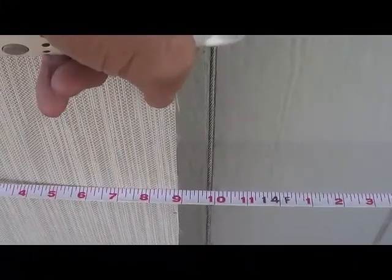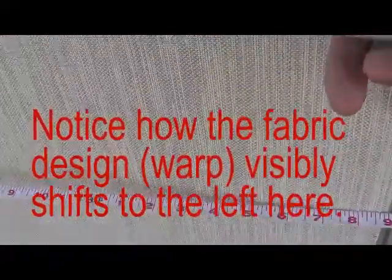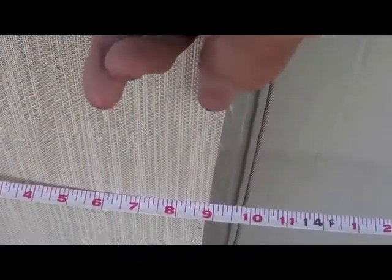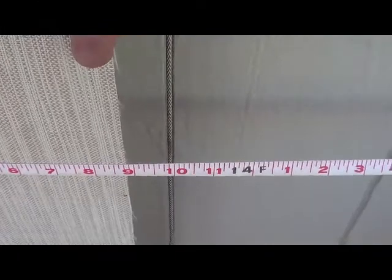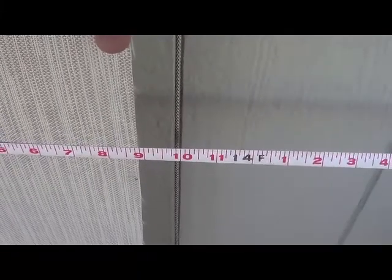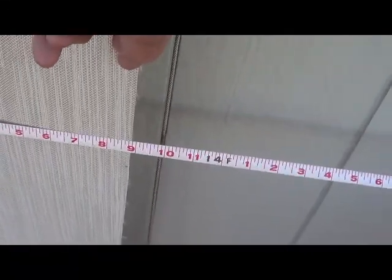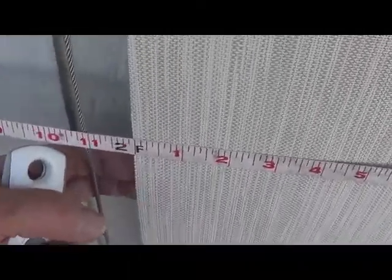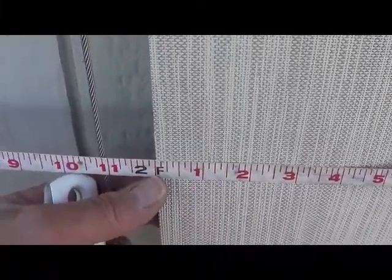And if you notice here, it shows 13 feet, 8 7/8 down here at the measurement. It isn't 13 feet, it's 2 feet, so it's 11 feet. And the actual distance is 11 feet, 8 7/8 inches. The reason for that is that I had to set the tape measure over here. It's set at 2 feet. You notice right here is 2 feet. So subtract 2 feet from the 13 feet that you're seeing on the inside.